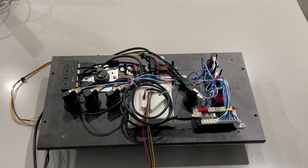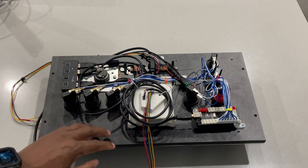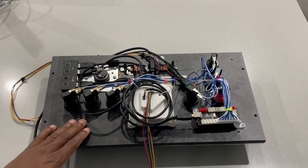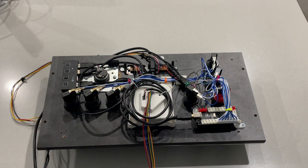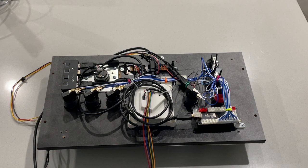We have our USB encoder board. What's different here is there's no OptiPak. We used to have the OptiPak here — we were going to run the spinner and the trackball into the OptiPak — but it doesn't have Y1, Y2, X1, X2. It has this thing called TX and RX, which is encoded, so it would be too hard to figure out how to use that. So we transitioned.